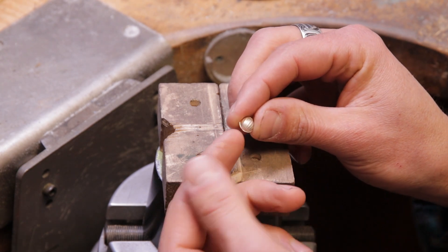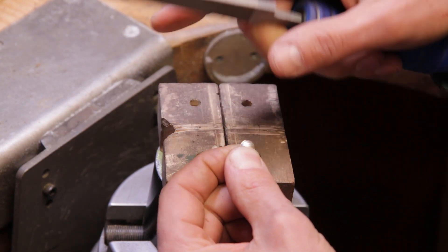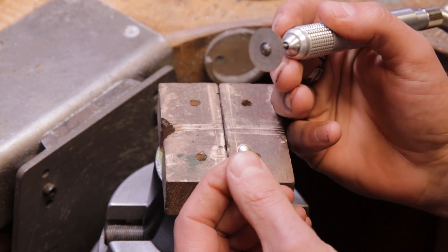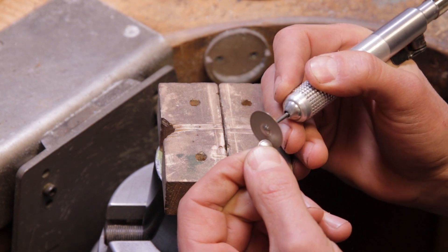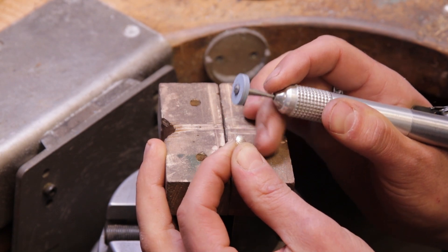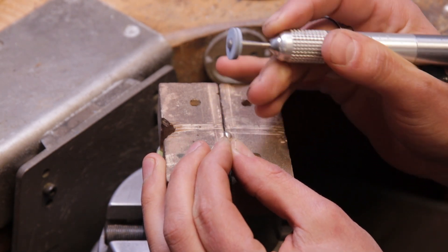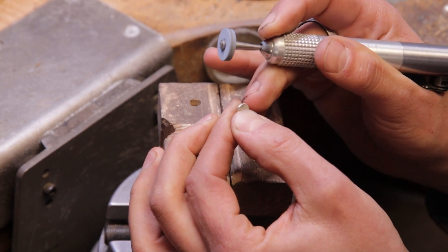There are a few different ways to remove the flange. The easiest way is just to use a file — this is a nice round shape, so it's easy to just go around and file that flange right off. Another way that I like to do this is using a diamond cutoff wheel. I'll leave the item number in the description. Using your Foredom flex shaft and this diamond cutoff wheel, it essentially acts as a nice file that you can control a little easier. After getting the flange all filed and cleaned up, I just want to go ahead and polish and smooth the back edge. So I have a silicone rubber polishing wheel — this is kind of a fine grit — and I'm just going to go around and polish this edge and smooth it out, then go around on the backside and just round that back edge out a little bit to make it nice and smooth.